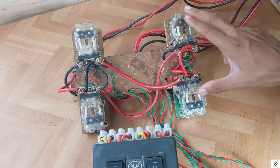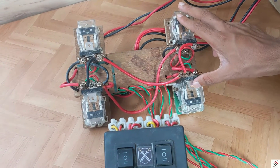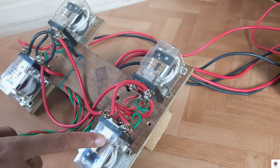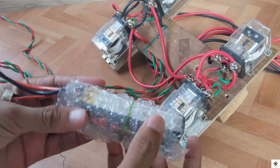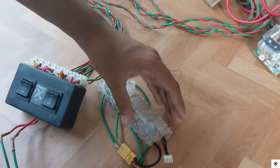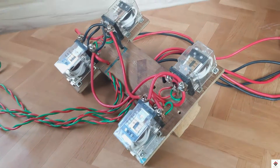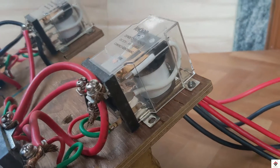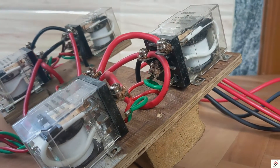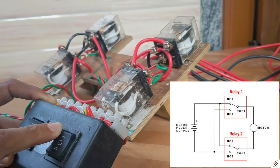In this case we are still using our spring type DPDT switches just to trigger the relay coil. These are SPDT relays and we need two of them to control a single motor — so two will be for the right motor and two for the left motor. Since the coils in these relays are 12 volt, we need a 12 volt power supply for the switches to trigger the coil activation, so I'm connecting a LiPo battery for the switches. For your reference, I have provided the relay connection circuit link in the description box.